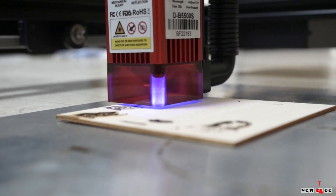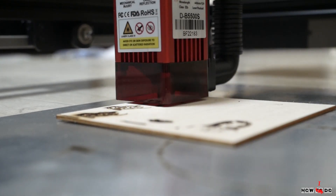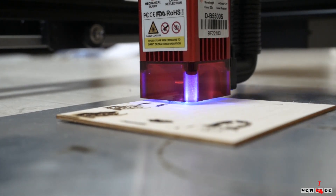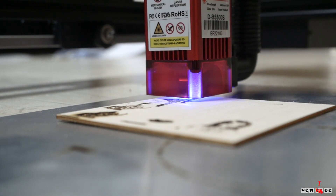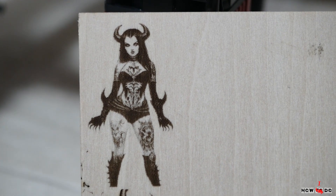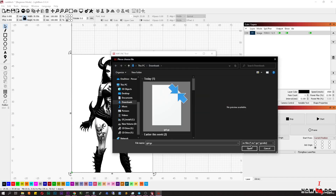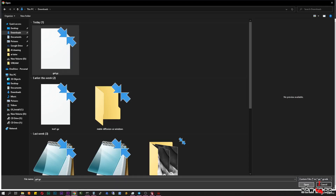As mentioned, you can run this laser from USB, Wi-Fi, or memory card, and all methods work fine. However, there is one important point: the air filter only works when starting from a memory card. I contacted Flying Bear and asked if I was missing something, but they said there is no way to turn it on remotely. Since I live in a tiny apartment and don't want everything smelling like burning wood, my workaround is to create a G-code in LightBurn and instead of running it directly from LightBurn, I save it as a G-code file, transfer it to the laser via the online interface, and run the file from the laser itself.